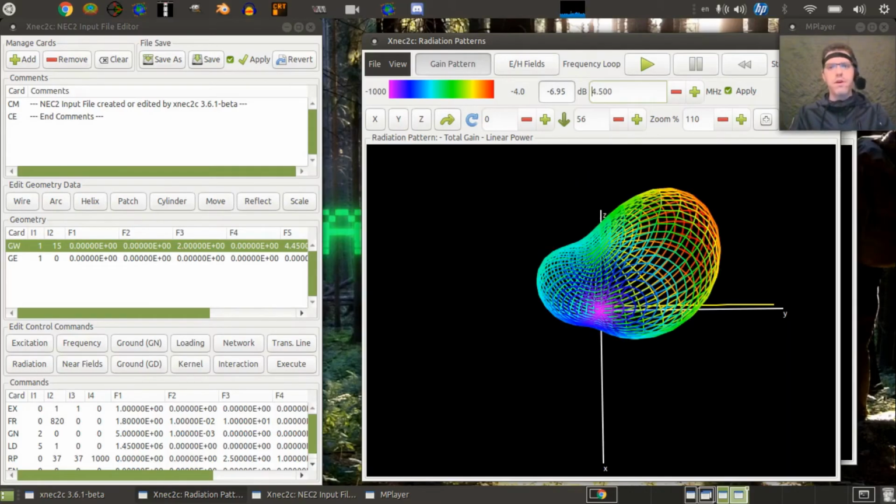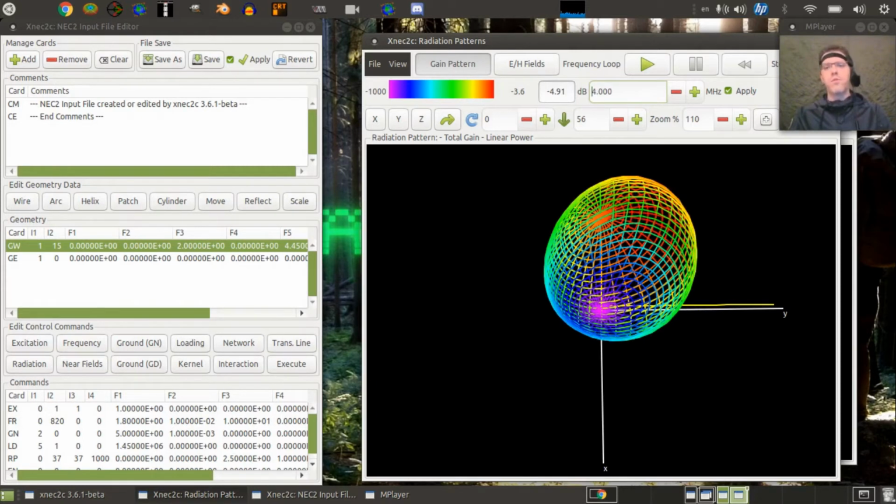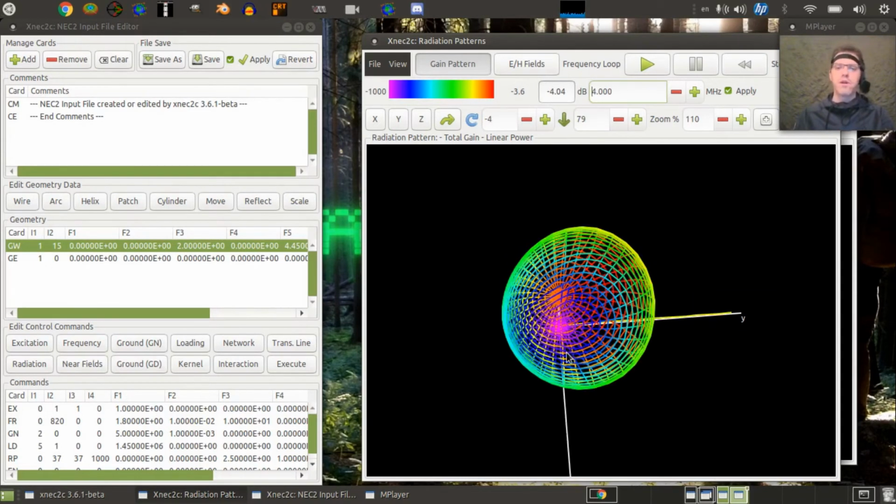So basically you could end up with a critical frequency, an foF2 frequency, of 5 megahertz here in the summer, in the middle of the day, or a couple of hours after 12 noon, and then you could actually use it for near vertical incidence skywave. But that doesn't happen very often. Usually it's below this, and usually you have an foF2 of 4.5 or something like that. That means that you would have to use the 4 megahertz frequencies thereabout, and that would work for near vertical incidence skywave.